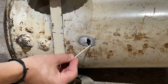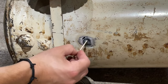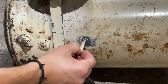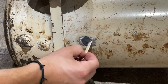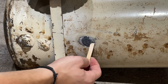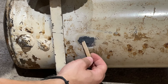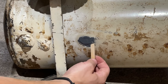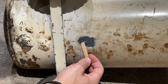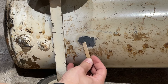Now we'll take this and mix it around all over the top of that hole. When it turns into a nice steel gray color, the epoxy is ready. At this point I want to spread it more to the top side of the hole due to gravity, or you could rotate the tank so this is on a flat surface — that would be best. But sometimes the air compressor tank is too big or the hole is just not in the right place to do so.